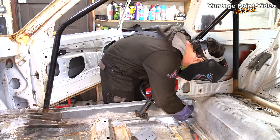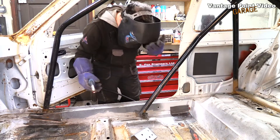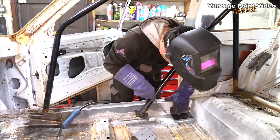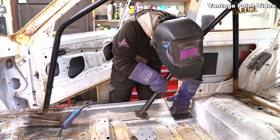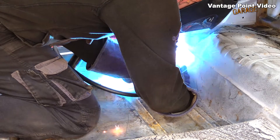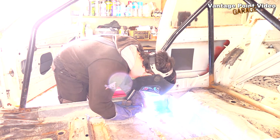I'm still learning from experience with the welder. I'll put a tack on just to hold the piece and make sure it's in the right position, and as there will be a join there in the weld it won't be so bad because it's on the inside. I was about to do one on the more visible side but it was in nice and tight, so I decided not to and just continued that inner weld. I then did a longer, more continuous one on the outside.